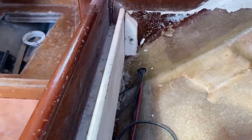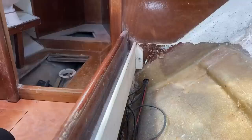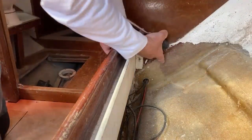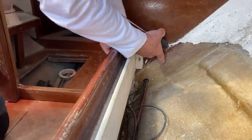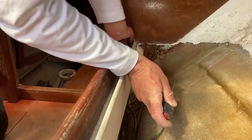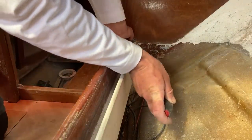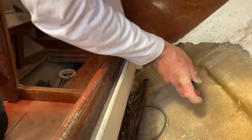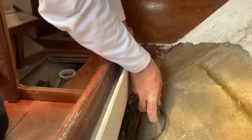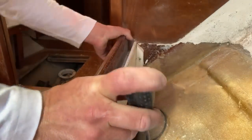And if I came in with a screwdriver or something I can tap it with, you'll be able to hear the sound difference. So I've just grabbed a screwdriver, and if I tap down here on the side that is a slightly darker colour, you can hear it sounds like this. And that's all solid. But if I go down to here, it sounds different, it sounds a bit more hollow. I'll just do the comparison again. So there's a big marked difference in how that sounds.